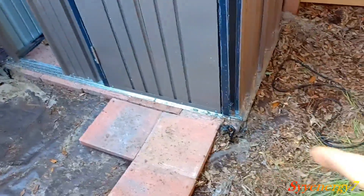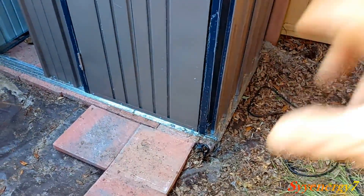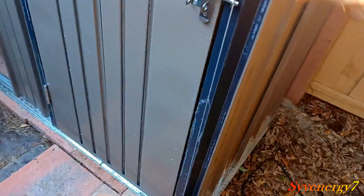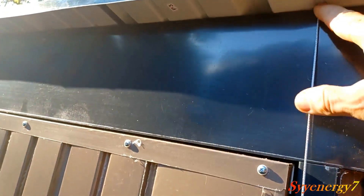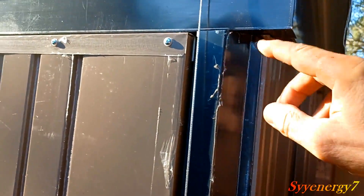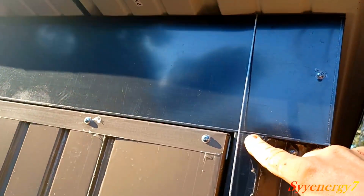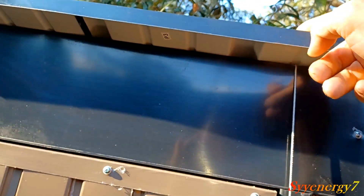On the other ones I had, I put cement around the augers after everything settled in. If the augers aren't tight enough you just screw them down a little more — it's an auger, it goes into the ground, but don't make them too tight. I have the strap going over the wall, not over the roof, and I did them as close to the corner as possible because that's the strongest spot. You want them on the corners. Sometimes people bring them in further, but in this case the door wouldn't open. Don't go over the entire roof because the wire will scratch and bend the roof.